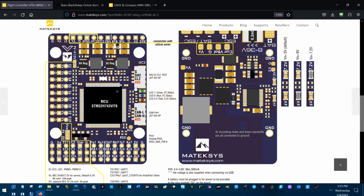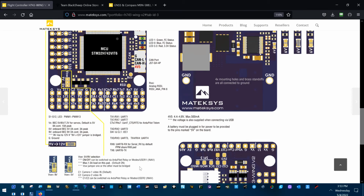I did put it here to start with until I started hearing people talk about this and looked at it myself and said, oh, yeah, it's going to pull more than 500 milliamps. I don't want to blow up my board. So that's one thing I would like to talk about in the Crossfire Nano Pro receiver. Watch out where you power it. And if you use it on max power, you could blow up the voltage regulator behind this pad. It's not physically behind the pad, but electronically.